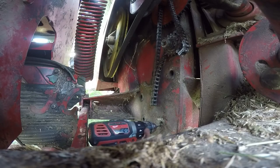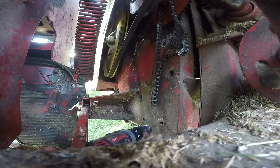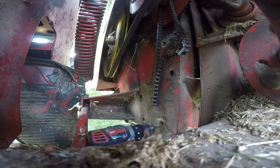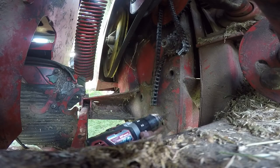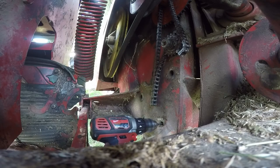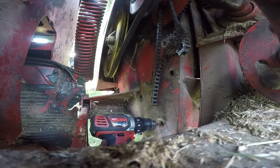Well, it was so loose. There's all sorts of dust. Man, I hope there's still some threads left on this thing. That one's deep — I know why. There's a nut on the other side of this plate here, a half-inch thick chunk of plate. What New Holland does is they weld a nut, so there's no threads here. That's why that one broke off so deep. I can find the center of the bolt — hopefully the center.